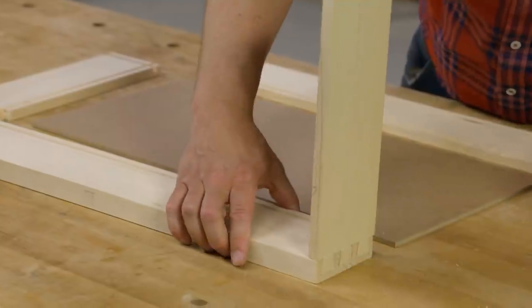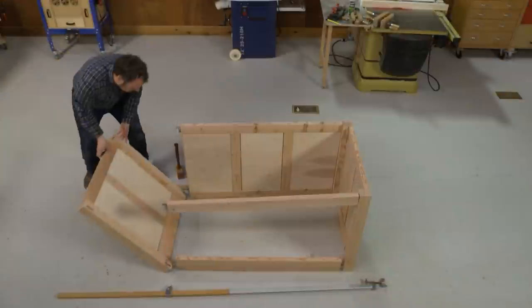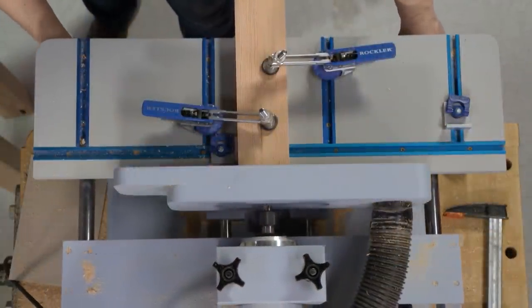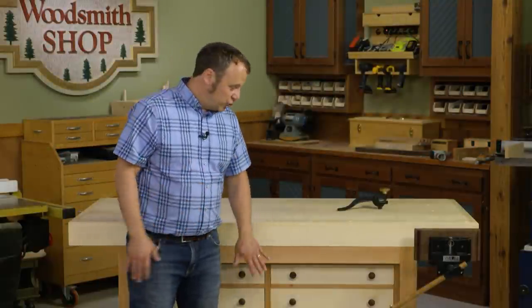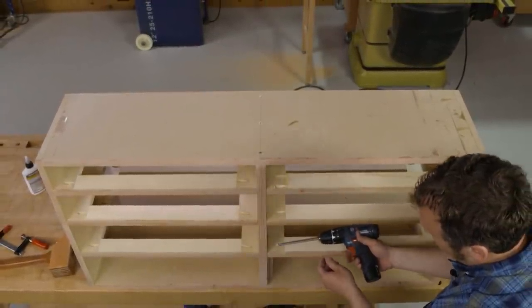Now speaking of the drawers, I stepped out of my comfort zone a little bit and tackled hand-cut dovetails on the sides. Are they perfect? No — but if you look too closely when you come to visit my shop, I'm going to ask you to leave. For this workbench build, we're going to divide it into three segments. There's the main base joined with mortise and tenon joinery — loose tenon style, cut with a mortising machine — made from reclaimed Douglas fir. In the second video, we'll look at the drawer case, an MDF box designed to hold the drawers, with pocket screws to simplify things.